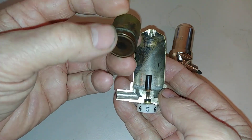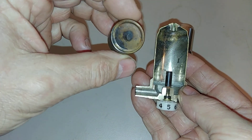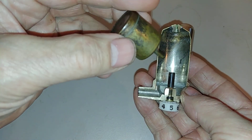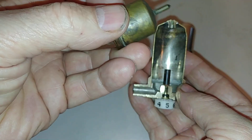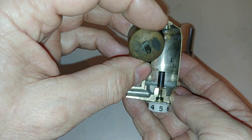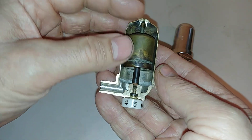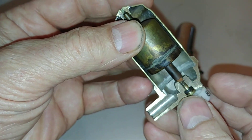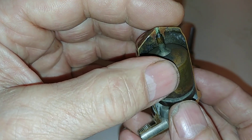This is a float chamber — the heart of the vent. It is a chamber made of brass with a bottom of a thin, flexible material of a different alloy, which allows it, like an oil can, to pop in and out as the fluid inside expands and contracts. It has a point which sits in the hole, and as you vary this you're varying a very fine screw which raises and lowers the float and the shutoff point.